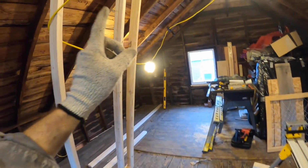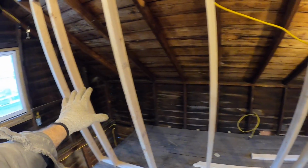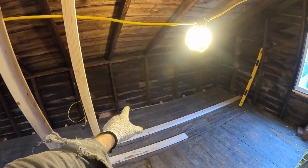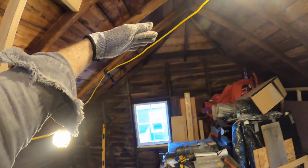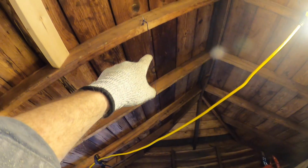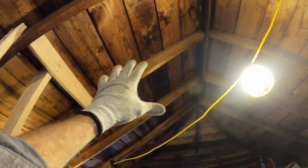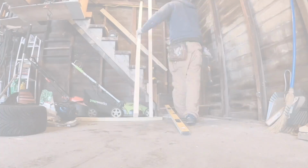And then at this point, this is exactly 8 feet over. That way I can sheath it with single sheets of plywood. There's gonna be a wrap, and over here next I've got to build a knee wall so that the next wall can slope off of that up to this string line here, which is just a little bit higher than this one ceiling wise, but still gives you, if you're on the wall, some headroom up above.